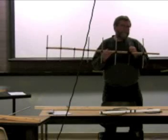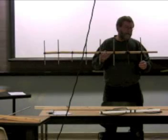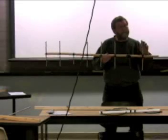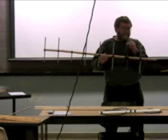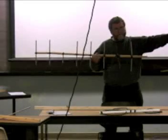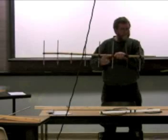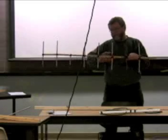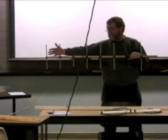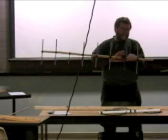If we want to make an antenna that's got a little bit of gain, we can put behind it, on the back side, what we call a reflector. Or alternatively, we can put in front of it, rather than back of it, a director. The difference is a reflector is a little bit longer than this driven element, and it tends to block signals in this direction from getting to the driven element. A director, on the other hand, is a little bit shorter, and, without getting into a bunch of theory, just in a practical or intuitive sense, as signals come in, they develop fields in these various elements and kind of focus the energy in on this driven element.